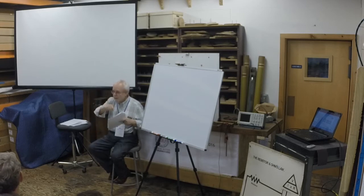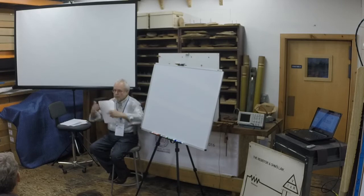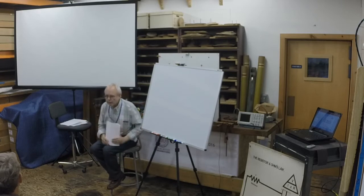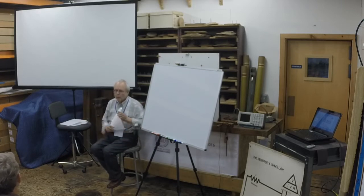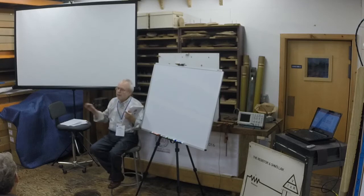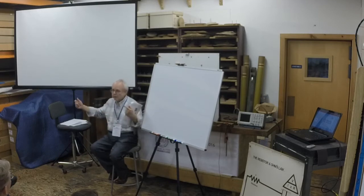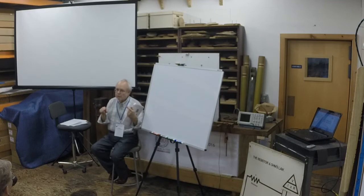The idea being, if someone hasn't tightened the screw on one of the electrical outlets, it can get fed from both ends. I tend to do much the same thing in organ wiring, where, for example, you have a rail of thumb pistons, and the common goes loop-de-loop all the way along. You could just feed it from one end, but what happens if it breaks somewhere? Well, if you feed it from both ends, you'll never know it breaks the first time.